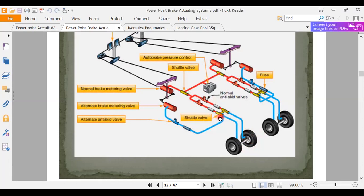Over here on the right, they say fuse. See this fuse? What happens when, I've said this a couple times, we run over a fox and the fox wipes out our brake hoses on this? We start dumping our hydraulic fluid overboard. The fuse says, hey, wait a minute, the brake should only take 1 gallon of hydraulic fluid and it's dumped out 5 gallons. It will close and put a tourniquet on the bleeding. And now you don't lose all your hydraulics. That's what a brake fuse does.